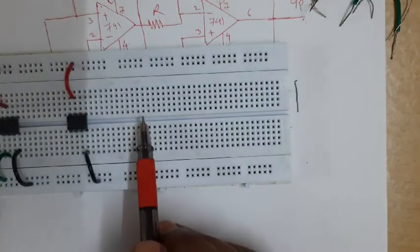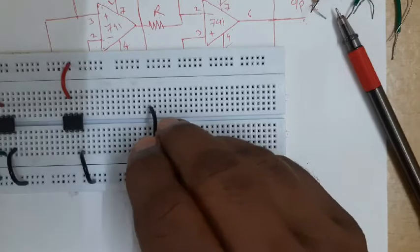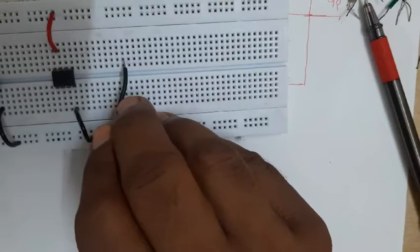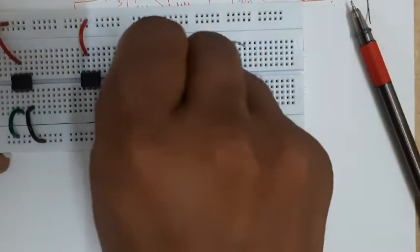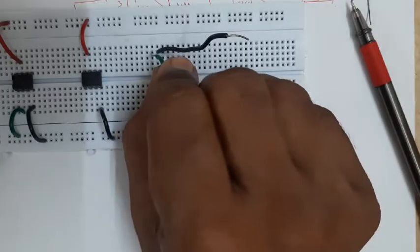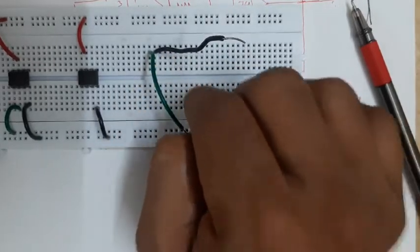The reason to avoid adjacent holes is that so many students have used this breadboard. It may happen that an inserted wire is too long and comes out from the back side of the breadboard, and then wires from adjacent holes may touch each other from behind. To avoid this, if adjacent lines are to be used it is better to use holes that are away from each other. If all five holes must be used, we then have to make sure there is no internal contact between holes due to breadboard damage.